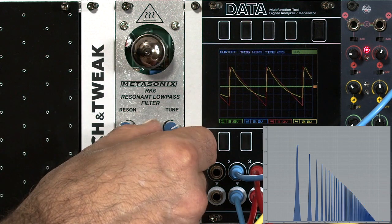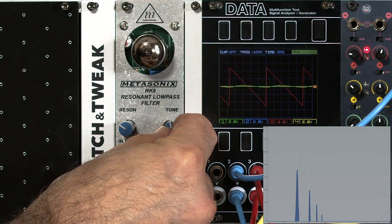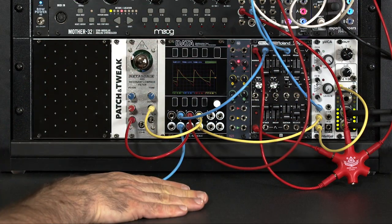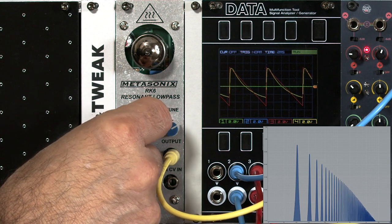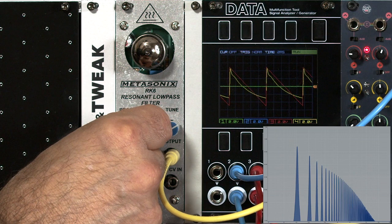The knobs are very touchy. Most of the active range of the tune control is in about the top 20-25% of its range. What that means is, when you envelope it, it does cut the filter off very low — you can use it as sort of a low-pass gate. As I pull my tune up and start increasing resonance, resonance as well responds only to the top maybe 25% of its range, and Eric says this is normal.